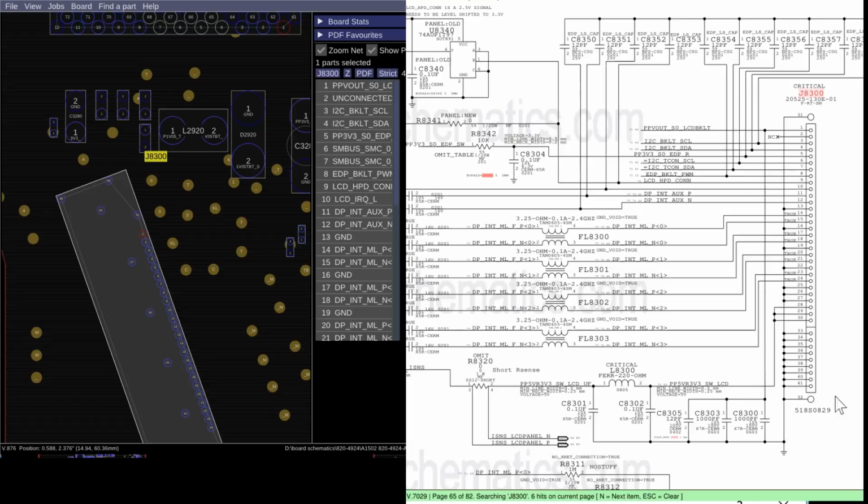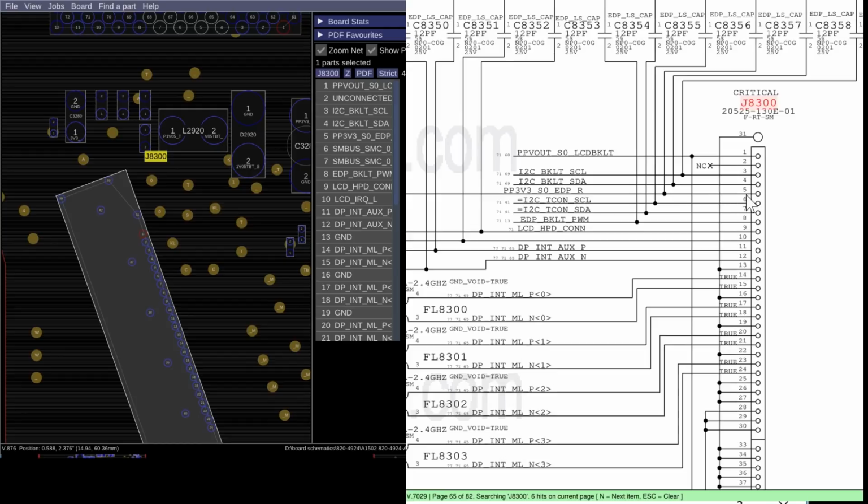And then up here, you're going to have a 5 volt data line for the backlight circuit. You have a not connected pin, which is going to be grounded, and then after the grounded pin, you have LCD backlight. So the same thing as is true from the 2012 model to the 2015 model, is that you have separation between your data lines down here, which are low voltage lines, and your 39 to 40 volt backlight line.